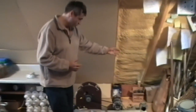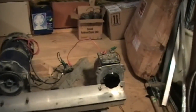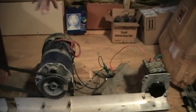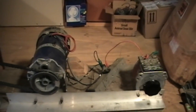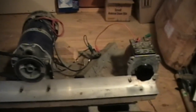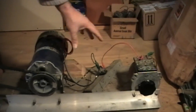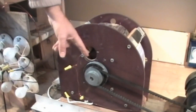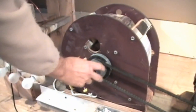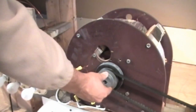We'll start over here at one end. This is a variable transformer to control the speed on the drive motor. This is a standard drive motor — it's not been altered. It draws 7.4 amps and 90 volts; that's what it's rated. You can do the computation and see what horsepower the motor requires to run properly. This is a diode bridge. Over here we have a variable transformer, diode bridge, motor, a belt that turns the pulleys that goes to the rotor of the main generator. You can see the rotor turning in there.